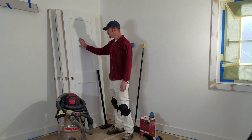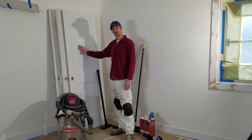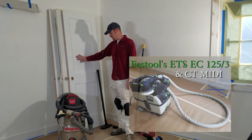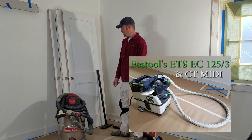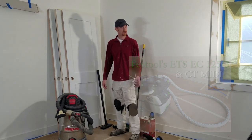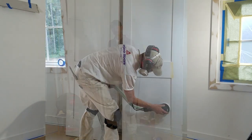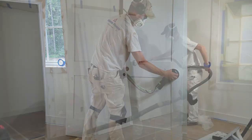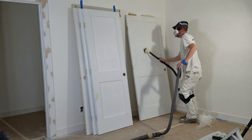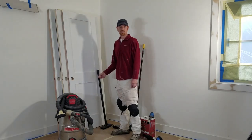These doors and all the trim had factory MDF primer on them that I'll get sanded down. We use machine orbital sanders — I'm using Festool at the moment, hooked up to the CT MIDI as a dust extractor, and that controls a lot of dust on the job site. We sand all the windows, baseboard, and the doors after we put the filler on. We sand the filler and the primer down at the same time, and the Festool vacuum really controls a lot of dust. But we still have to sweep floors and vacuum off the surface of all our trim before we do any more prep work, caulking, or spray the job.